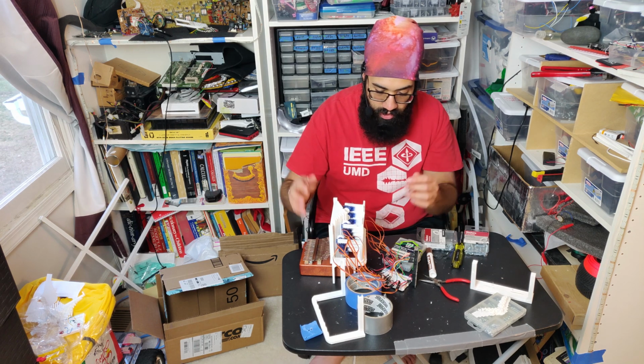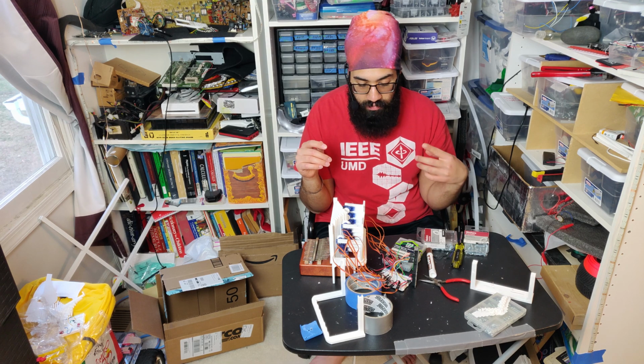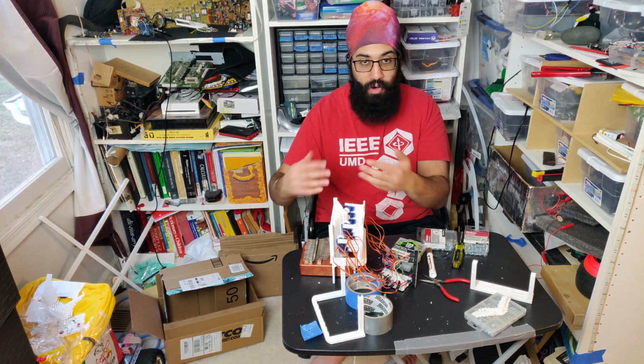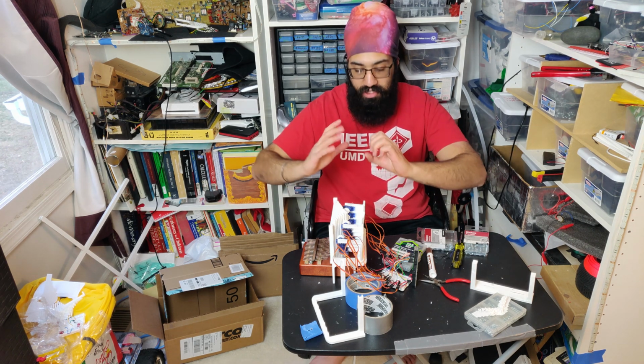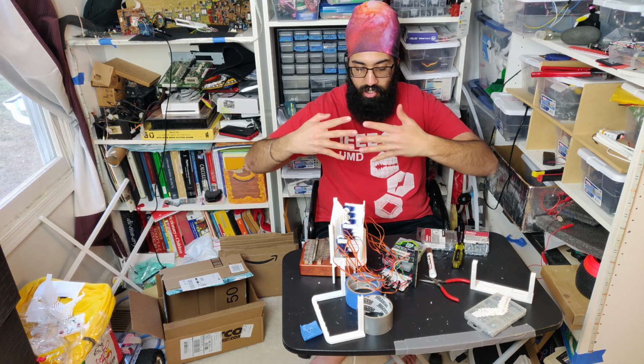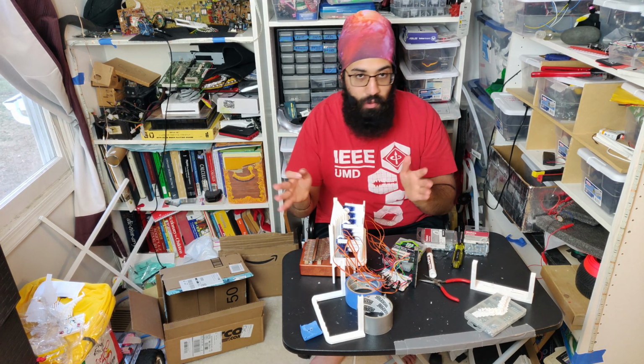something like that. But you notice an issue, these things are kind of slanted, right? So that was a big problem that I faced. Also, the pinions aren't meshing with their racks properly. So the gears are like this rather than meshing together. They're like this right now. So that involves some sort of adjustment. We can work that out.